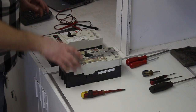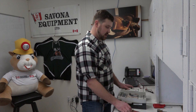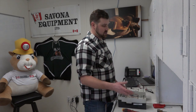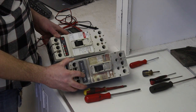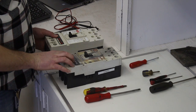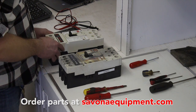To replace the front of these breakers, all you need is a simple Phillips screwdriver. Inside there's another screw — it's a Phillips as well but just a bit bigger — and that's when you can change out the adjustable trip, the magnetic trip. This one doesn't have one, but you can add one from another breaker or order the part if you need to.